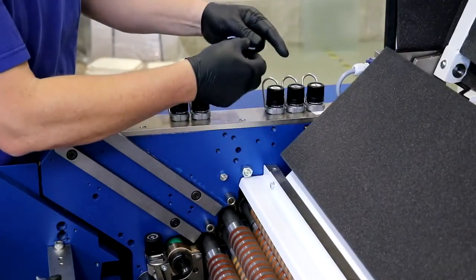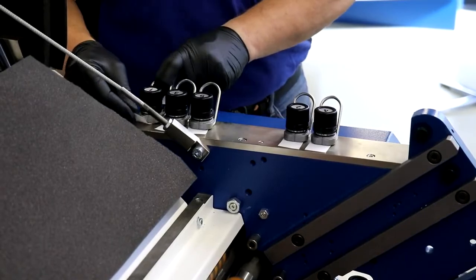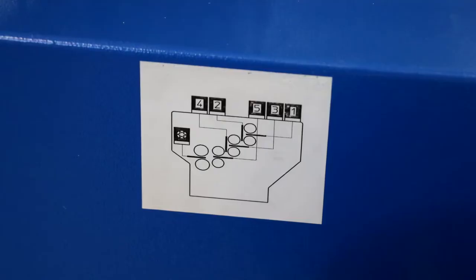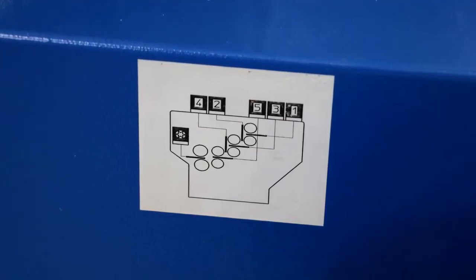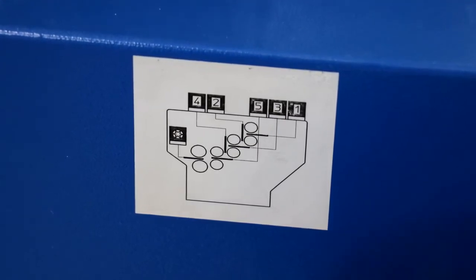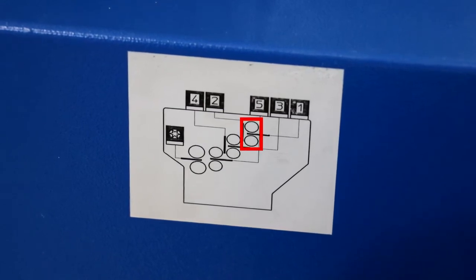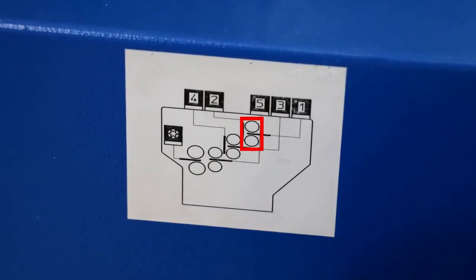Underlay all fold roller calipers of the folding unit on the operating and drive side with a single layer of copy paper. Note the graphic on the side cover of the parallel fold. Here all fold roller gaps to be measured are assigned a number and a caliper. The infeed fold rollers of fold roller gap 1 must be measured from on top of the alignment table.